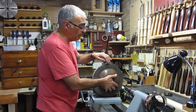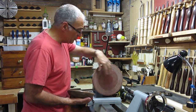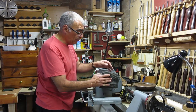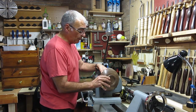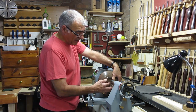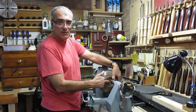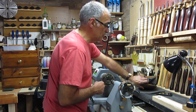You can't use what I would also use, excuse me, having the chuck in there. Yeah, and the method I'm talking about there is if you had a normal bowl, you'd have your chuck in there, you'd put either non-slip matting or mouse mat or whatever, and then your bowl would fit on there and you'd centre it up, bring up your tailstock to get it centre, and then once you've got it centred then you can turn your foot away. You can turn your foot away, but that of course will leave you a little nub in the middle which you can hand sand away. So there are those options if you haven't got button jaws.